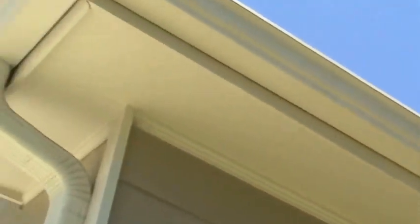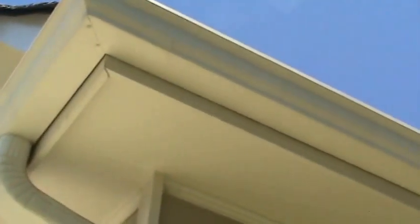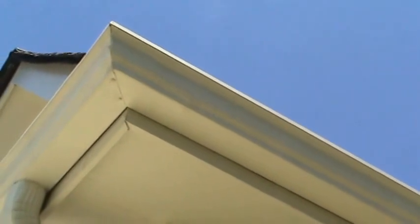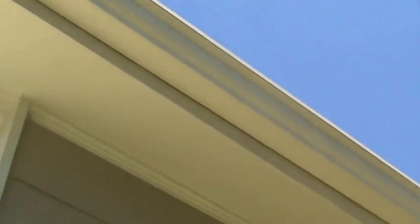It hasn't rotted out yet, but it looks like he's done some repair work in this corner. See the screws in the bottom of the gutters? We talk about this all the time because we see it all the time — why would you put screws in the bottom of your gutter? That's what's conducting the water. It's going to leak and rot over time. You can see it's leaked a little bit and it's just starting to rot this corner of the fascia board. Our boys will check it when they come out — if it doesn't need to be fixed, he needs to at least seal these screws if he can't afford new gutters.